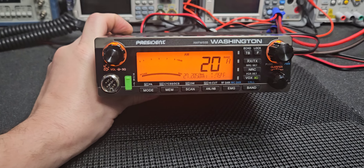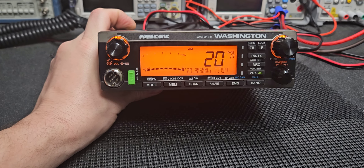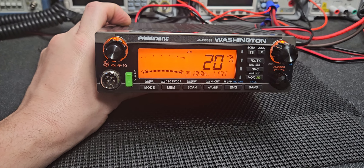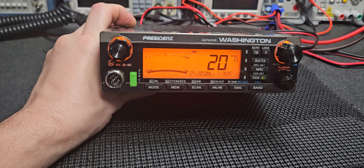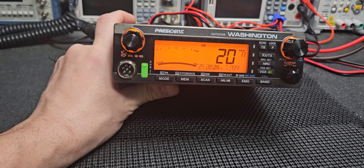Sideband — these usually do between 60 and 80 most of the time on voice peaks, so you can expect about the same out of this one as all the other ones. I'll come back and show some of the power and stuff after. I'll set your modulation on AM to about 95 percent, and the FM deviation I'll set to about 4.1 kilohertz.